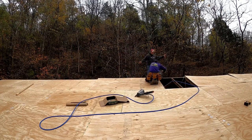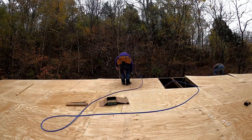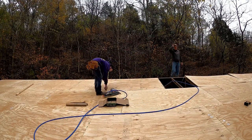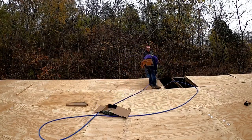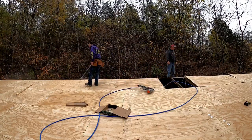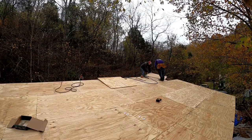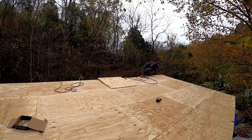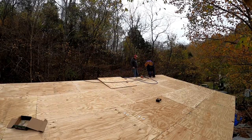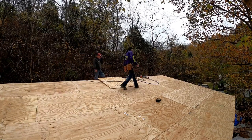They make clips that space these boards and support them in between the trusses. See, my trusses are on 2 foot centers, so you're walking basically on the ply with no support under it in between each truss. This 5/8 ply, in my opinion, doesn't need them, but if you were using something thinner, they'd probably be a benefit rather than a hassle to install, and make your roof more solid by connecting each piece to the next.